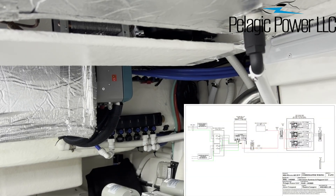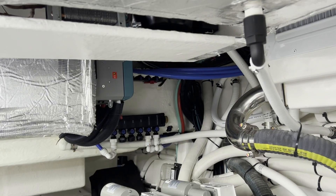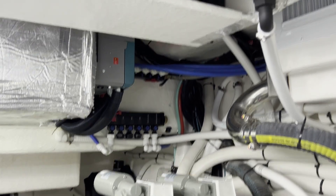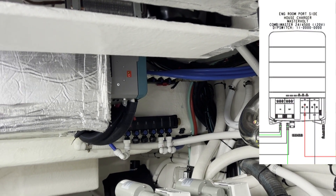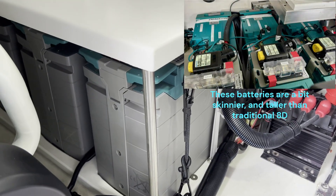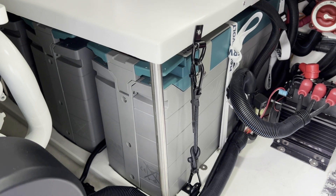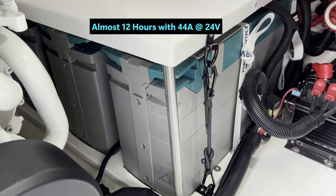Next I'm going to show you this really cool install we did on a Riviera 465, only one year old. The customer wanted to upgrade to a large lithium system and bigger inverter so they could spend more time without the generator running. In this corner we have a 4500-watt inverter — this boat is 24-volt. That inverter was upgraded from the factory inverter so they could invert more loads continuously. When you have a big inverter, you need a bigger battery bank, so we also upgraded the house bank, which is now three 6000-watt-hour Mastervolt MLi Ultra batteries. For this boat, it allows it to be on anchor for almost 12 hours with the devices running that they want before they need to start charging — it's a massive amount of battery power.